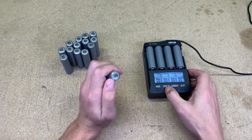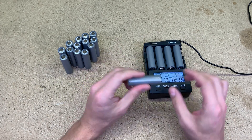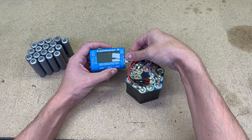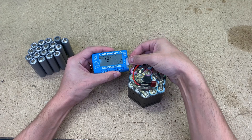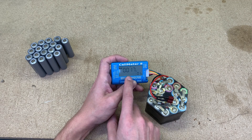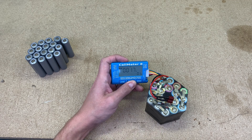Now, the reason why my 100W LED flashlight needs a new battery pack. The old one, which was built 3 years ago from used 18650 cells, just failed — specifically, one group of cells connected in series failed. Due to another 5 groups of cells not being in the best shape either, I decided to build a new battery pack instead of repairing this one.